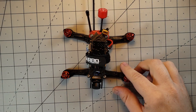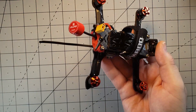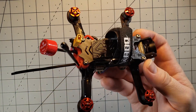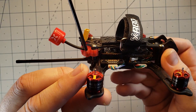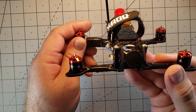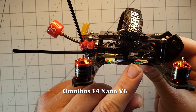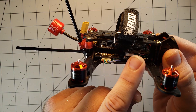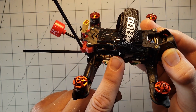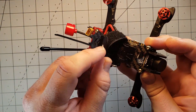And finally, we are together! That was a fun one. So let's talk a little bit about what's in here. We've got an R9MM — I put the antenna out the back in an L shape for now. I may end up changing that after a test flight. We've got the Tachyon 1108 5000 KV motors; these may get swapped out for some RCX 1304s. The Caddx Turtle V2 is on the front. Inside, the flight controller is on the front side on the bottom, with the Caddx board on top of that, and the R9MM on top of that. In the back, we have our 4-in-1 ESC, and on top of that an AKK FX3 Ultimate connected with a Lollipop V2. Put a little bit of UMA grip on the top so we can keep our battery in there.